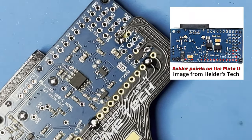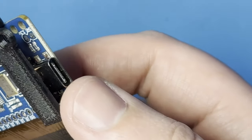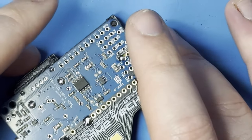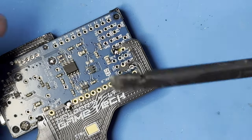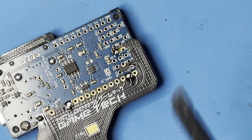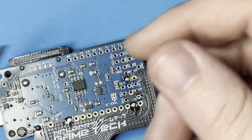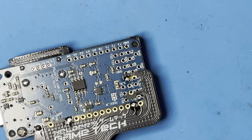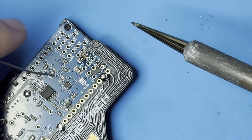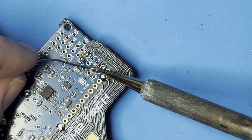I did double check the pinout. On Helder's Tech website he's got a picture of the pinout, but it does not line up with what I have here. I believe the difference is that I have a newer revision of the board — this one is USB-C, which I believe is for programming it. The one in the guide uses an older or just different revision. I'll continue with what I've got because from what I can tell it still lines up, especially with the help of Macho Nacho's video, which I'm also linking in the description. He's got the other revision too but it lines up with what he's doing. The ribbon cables have also changed — these have full circle pads on them whereas the ones in both videos have half-moon pads. So they're all different.